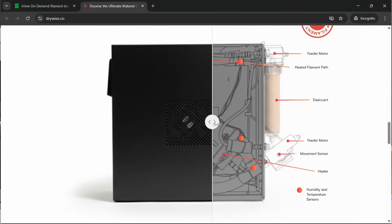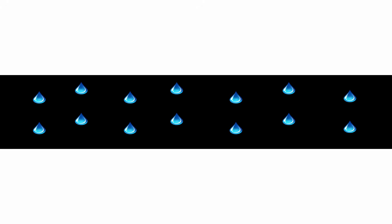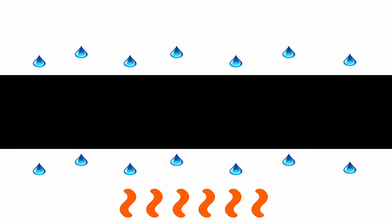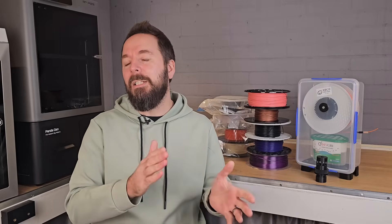Finally, inline drying is technically possible — especially for the more hygroscopic filaments. Anything that absorbs moisture quickly will also give it up quickly, so it could be a good solution for materials like PA or nylon. We'd also need to find a way of doing it that costs a lot less than the commercial options. The basics of filament drying are that you need to excite the moisture inside the filament with heat to get it moving, then have dry air next to it to carry the moisture away. Different filaments handle different temperatures — PLA can only tolerate around 55°C, which means moisture moves around less and takes longer to draw out. Nylon can get a lot hotter, so it doesn't need to be processed as long. This makes inline drying more practical, but there are challenges to overcome.